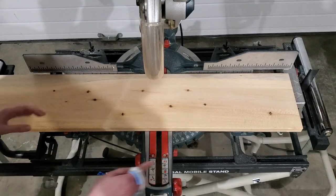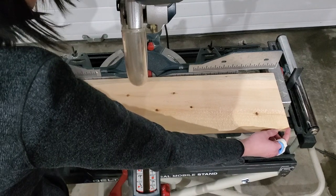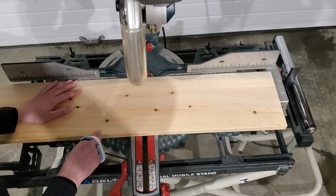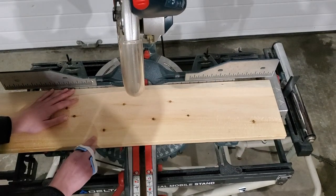What I'm going to do first is cut this angle here first. The reason why I'm cutting this angle first is because if I accidentally cut this top corner shorter, my whole measurement of 20 inches is going to be off. So I want to make sure I'm cutting this angle first, and then I'm going to re-measure my 20 inches.